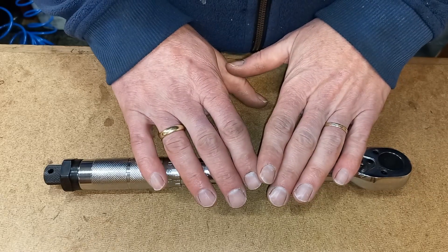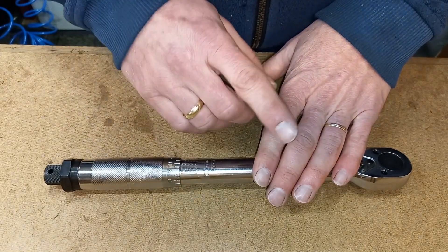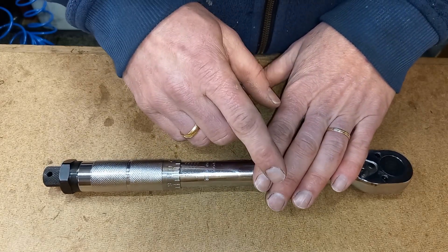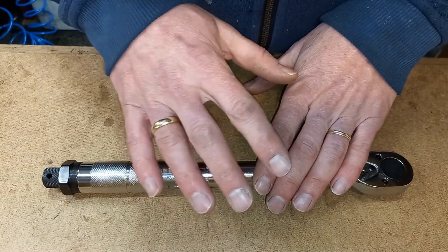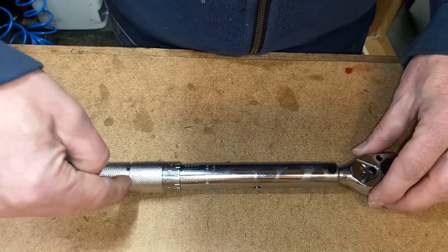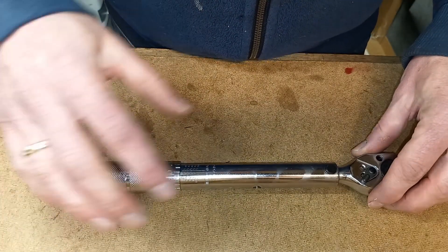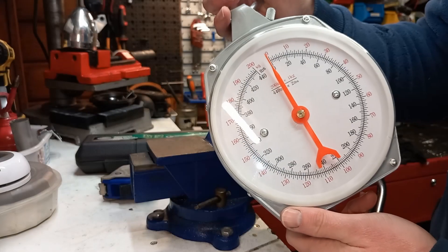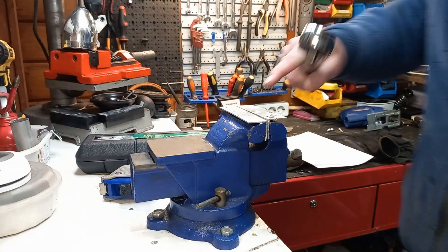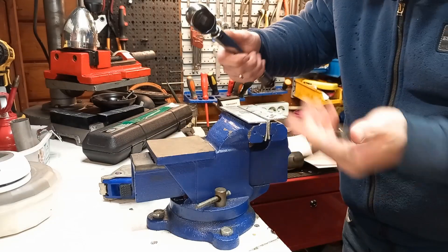In the previous video I showed you how I checked my scale, but that was for demonstration purposes only. If you want to add more precision, I would take a reference weight — in this case about 30 kg, the weight I need to apply to the band — and adjust my scale to that. I'm going to assume my scale is still correct, so I'll clamp my torque wrench in my vise and use aluminum jaws to prevent damage.